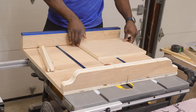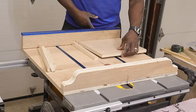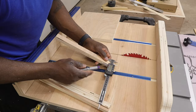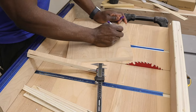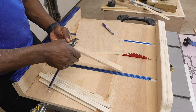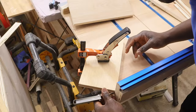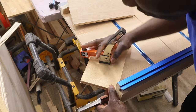So there will be some math, but he goes over in depth on how you can accomplish it. Essentially, you take your first four thin strip cuts, turning your square or rectangle four times, and on that fifth cut, you take about an inch cut, and then you use your calipers to figure out the difference between the top of your cut and the back of your cut.